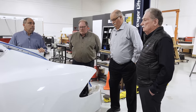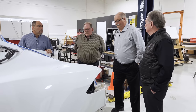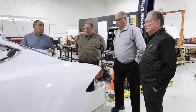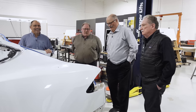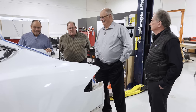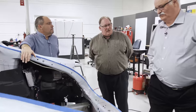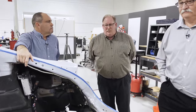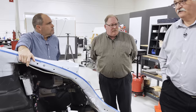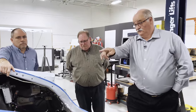Every time you eliminate a connector, your quality goes up. Connectors are the number one driver of poor quality for electrical products, period. Something a lot of people aren't aware of is that each connector and each terminal has a finite lifespan of connections it can make — sometimes as little as two or three — so rework becomes an issue in some environments.